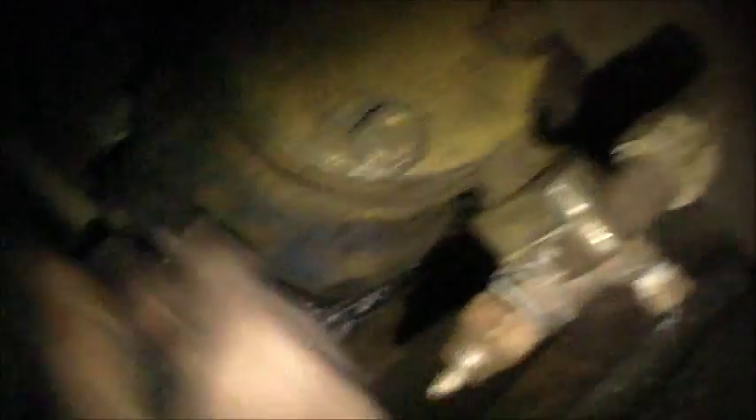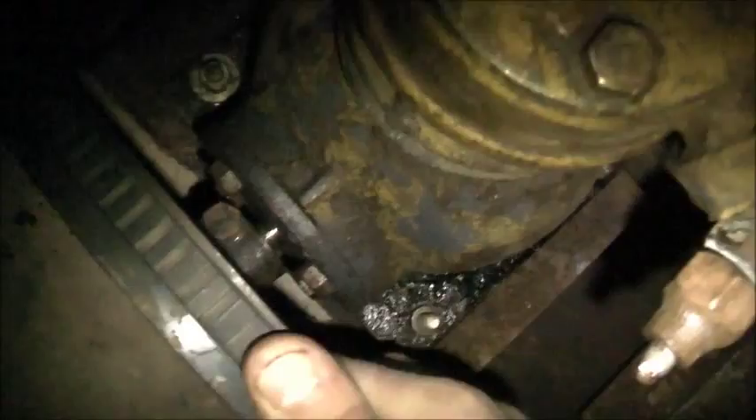Still a bit tight there, and that same spot's tight. There's no play in the bottom end — that's good. That's where that racket was coming from, because the shaft probably isn't perfectly straight — it's going like that. But when I pull this apart, it shows it allows for all that in the bottom end naturally, so this spring in there can go a bit tighter. It's adjustable.